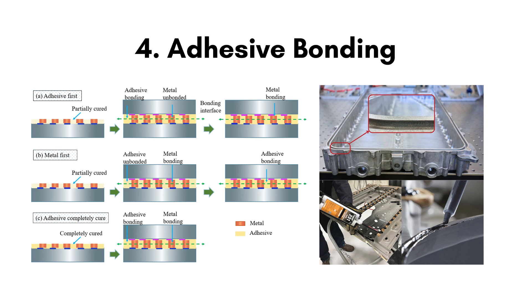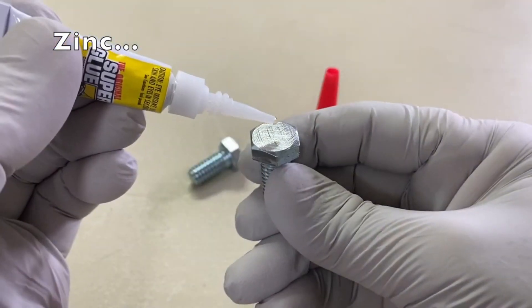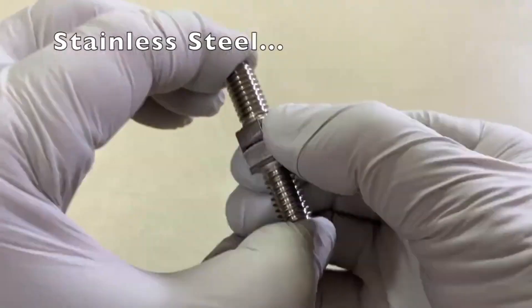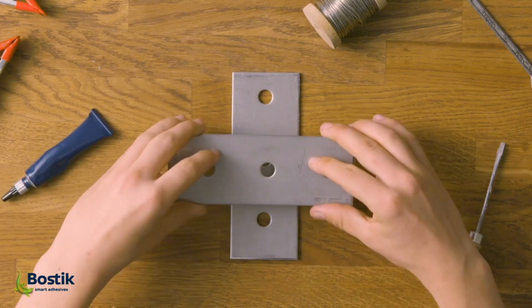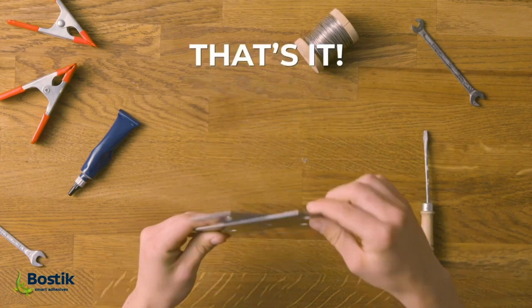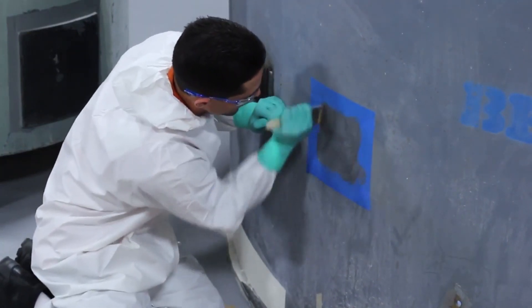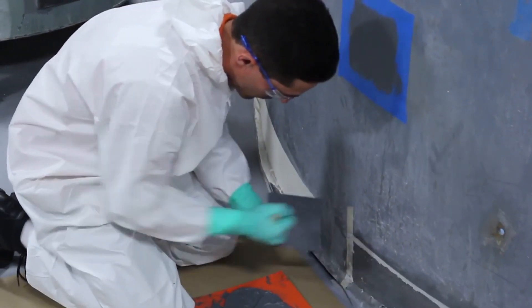Number 4: Adhesive Bonding. Adhesive bonding is the process of joining two surfaces together, usually with the creation of a smooth bond. This may involve the use of glue, epoxy, or one of a wide range of plastic agents which bond either through the evaporation of a solvent or through curing via heat, time, or pressure. Glues have tended to create relatively weak joints, but with the use of new self-curing adhesives, these bonds are now close to the strength of the materials themselves. As a result, gluing is now the preferred method of joining for many applications, particularly when the bond is not exposed to prolonged heat or weathering. Among the composite applications commonly bonded using adhesives are fiberglass and fiber epoxies like boron epoxy and carbon epoxy.